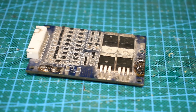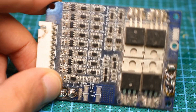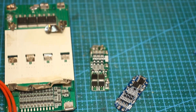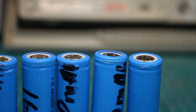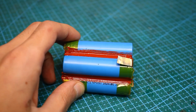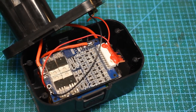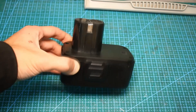The protection board will be without a balancing system. Usually that's not ideal, but these simple boards are acceptable when working with batteries that are nearly the same in internal resistance and capacity — and this is just our case. The finished battery looks like this; the cells are additionally fixed with sealant. The capacity of the new battery is slightly more than the old one: 1600 versus 1200 mAh, and of course the weight of lithium is much less.